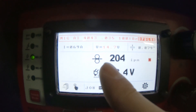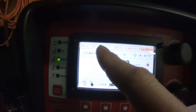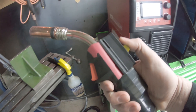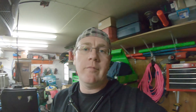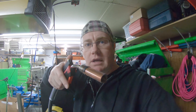What's really cool about this machine is it is a synergetic machine. Basically you change one thing and it will change your voltage, so you're really just varying the overall output. The way this is set up, it has a slider on the MIG gun that varies the overall output of the welder, which is awesome. If you're coming up to the edge of a joint you can back off and not blow out the corner, and likewise when you're starting off you can turn it all the way up and really burn it in, then back it down. It's a synergetic adjustment — you're changing both voltage and wire feed.